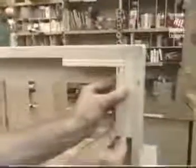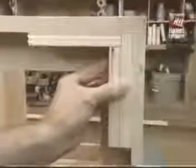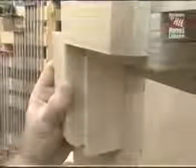Now a series of plywood fillers that go between the bottom frame of the lower unit and the edge of the cabinet. Just gives me a broader base to attach the other pieces. Next, these solid blocks of poplar. And there's no sparing the glue at this stage. This is all very critical.